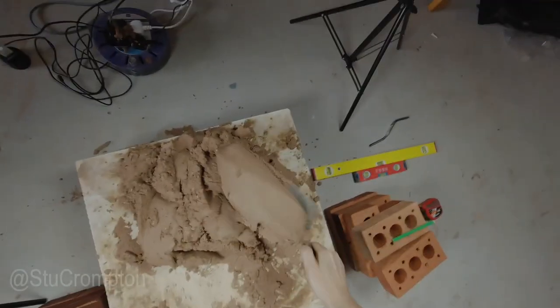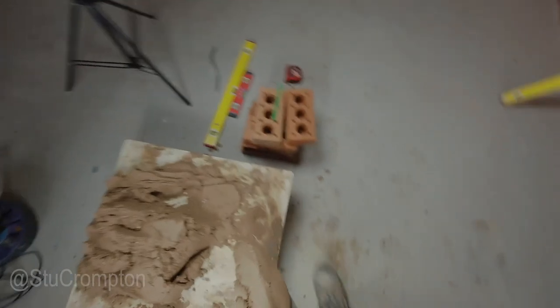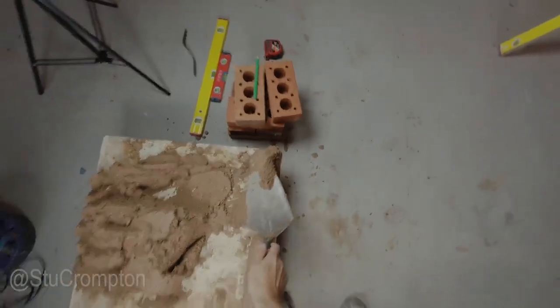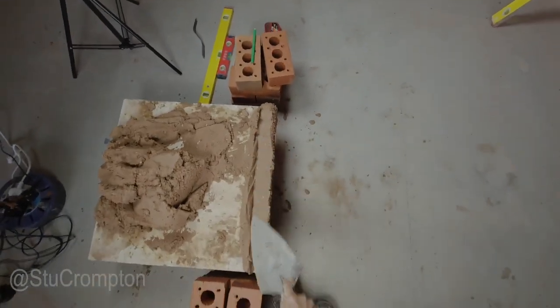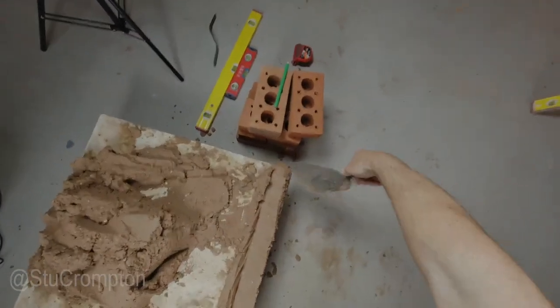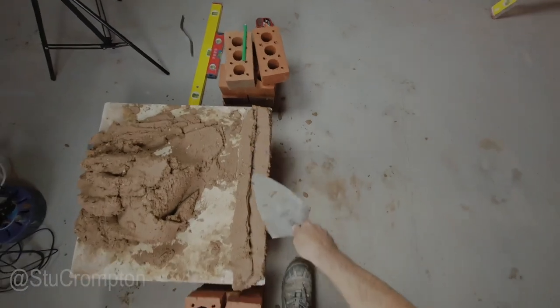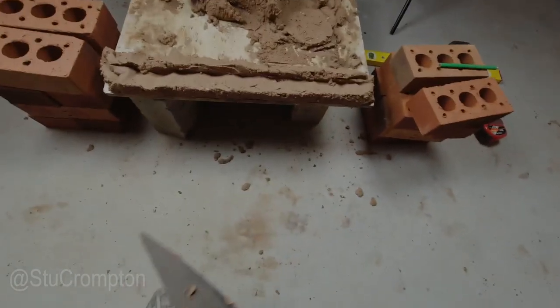We're going to use a technique which we worked on. Down the board like this — we're going to put it into practice now. This was the first lesson: creating that tub of their own shape, and then pushing our mortar out like that, scraping it and collecting it, and then just making a nice uniform bed with a gentle furrow to put our brick on.